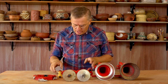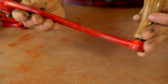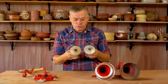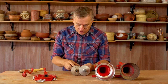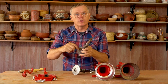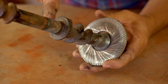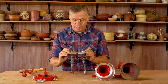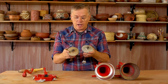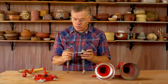Here are the parts. The handle could have lasted forever — the wood is a little bit cracked but this handle could have lasted another century easily. The screw itself shows a lot of wear, actually — the threads of the screw. You can replace the plate; the plate is where the material is ground, between these plates. There's a lot of wear on it but you can replace that plate probably fairly inexpensively — there's just a pin here, take the pin out and replace the plate. Interestingly, the old one has a 26 stamped on it and the new one has a 27 — I don't know what that means.